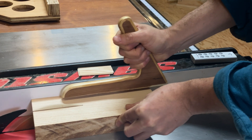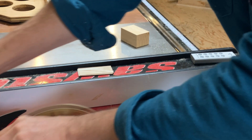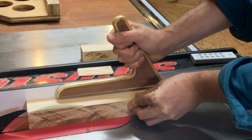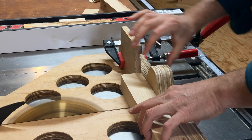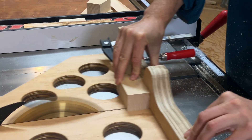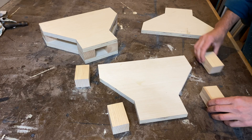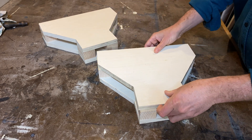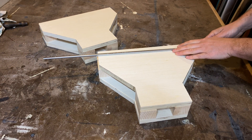Next I'm cutting out those four blocks for the pivot rods that go in each of the two octagon boxes. I'm making these from some scrap ash, ripping it down to width on the table saw and then setting up a stop block on my crosscut sled to batch out eight of these little guys. Here are the two octagon boxes with the four blocks in each one. There'll be holes in each block so the rods can pass right through and the arms can pivot on those rods.